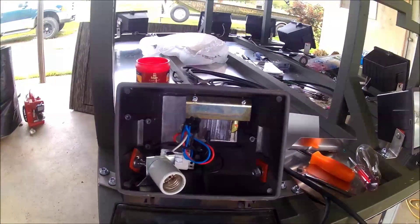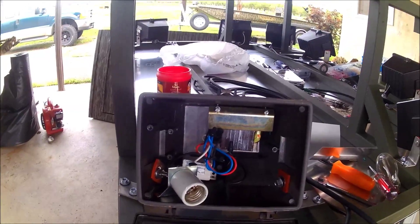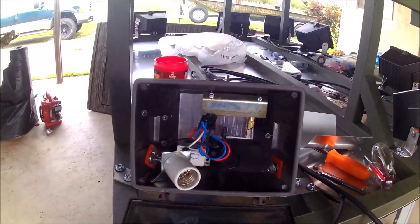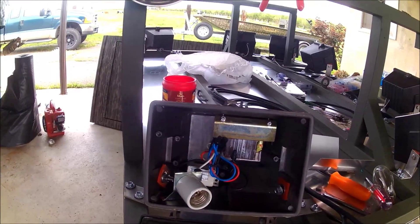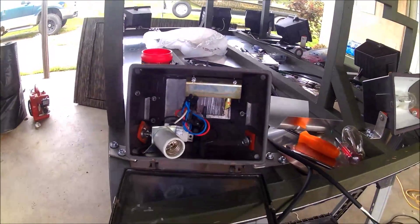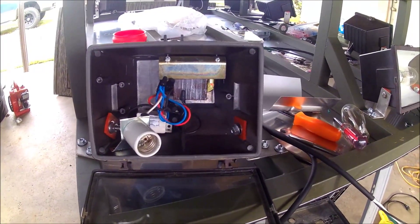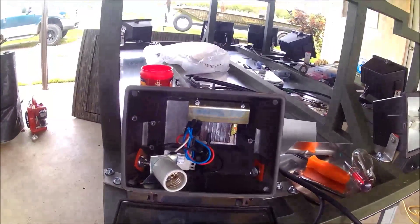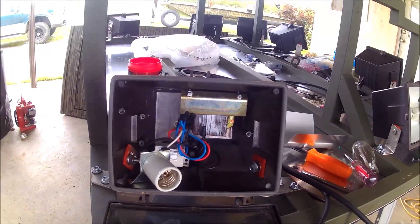We're wiring up the lights on Mark's platform and I have a golden opportunity to show how to add a capacitor to a 150 watt high pressure sodium. Now these are the more standard 6x9 high pressure sodiums that you would see at like a hardware store or on Amazon.com, not the 9x9 Econo lights that everyone seems to use.